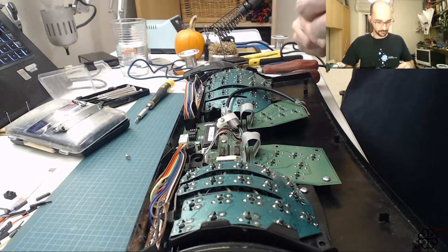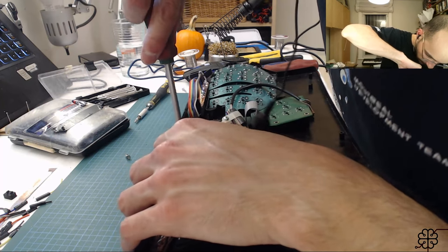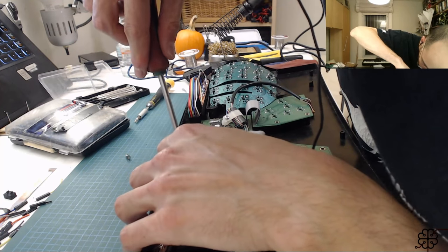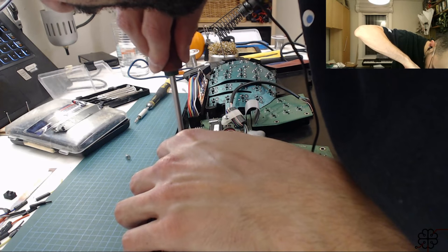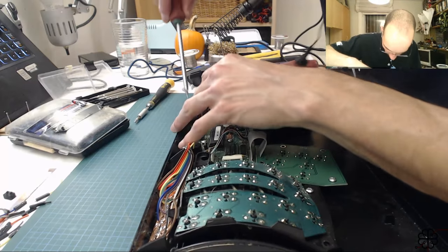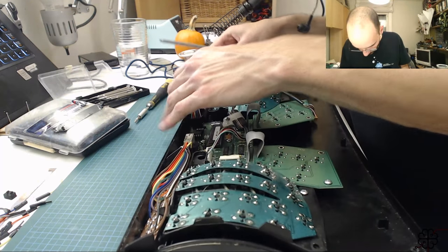Use these Robertson screws, which, by the way, rest of the world, Robertson screws rule. They are the best. Now that the patent's expired, you should start using them. They are amazing. You should read about them if you don't know about them. They're basically the square head screws. The amazing torque. The screws stay onto the screwdriver by themselves. Check it out, you just put it on the screwdriver and then boop, no need to stick anything. Magical as that, it's not magnetic either. It's just the screw head shape that does that. All right, it's not going anywhere.